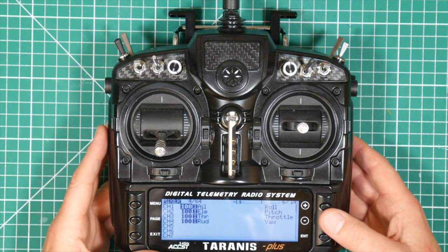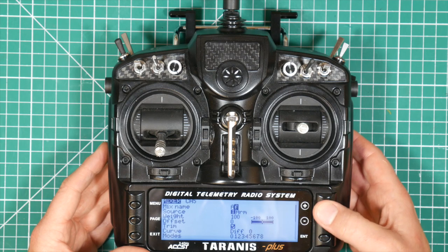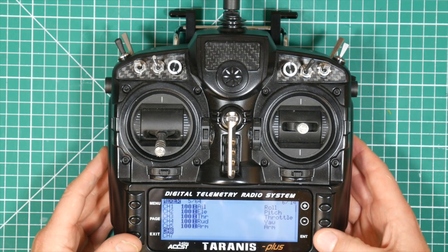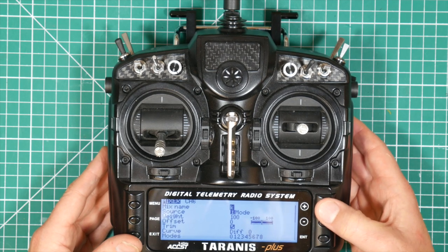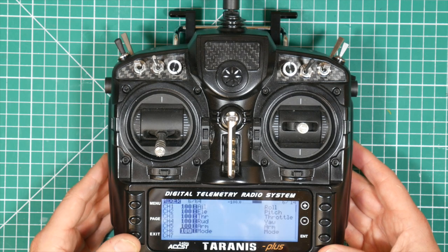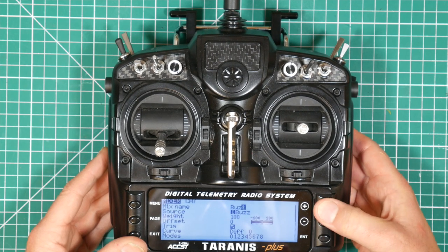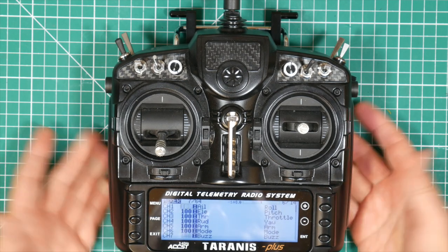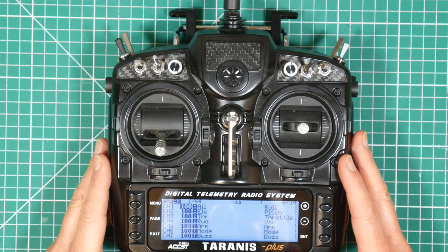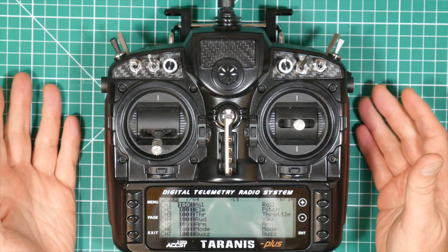We go to the next page, which is page 6, which is basically the outputs. So we bind those to the inputs. Mix name is arm. And the source is already set to arm. Good. Channel 6 we will set to mode. There we go. And the source is already set to mode. That's good. And we're going to create the last mix, which is going to be buzzer. And the input is buzzer. Great, so that's all we need to do. Run through that pretty quickly. There's loads of other videos on my channel that explain this, and there's loads of other videos on YouTube. So I haven't gone into any detail in that and the whys and wherefores. So that's already set up, and we now need to bind this to our receiver and set up the quad